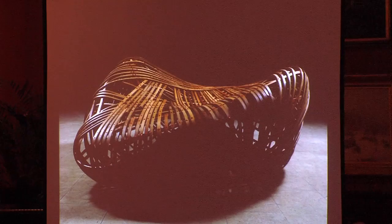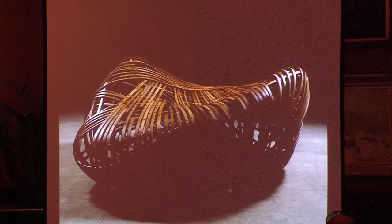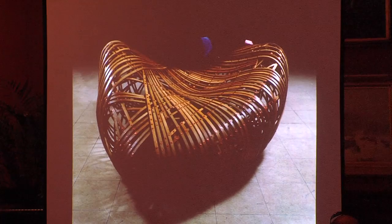This piece is all riveted together. Those are all copper rivets, but they're all hand-hammered copper rivets, so they're just like a nail with a washer and a peening hammer, which is actually a process I'm getting back into right now. It's really fun because every joint is a flexible joint. They're extremely strong joints, but they're flexible. Each one's a hinge. So when you sit on this, it's got a little bit of flexibility, but it's almost like a hammock. And extremely strong, just flexible, which is a really, really cool quality.